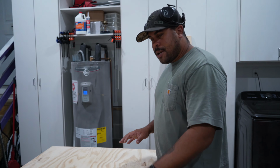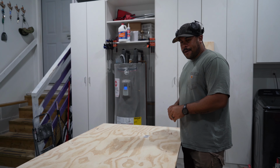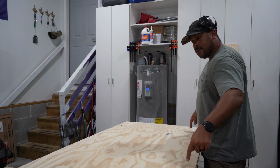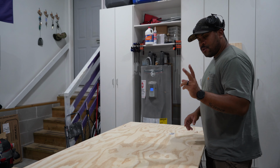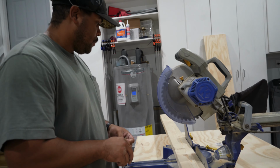All right, so the worktop is done, 3 foot by 6 foot. Next, we're gonna start building the framing. First, we're gonna build the horizontal framing. We're gonna do 2 layers of 2x4s, one that goes right into the countertop, one's gonna be down closer to the floor. This is upside down right now. And I think we're gonna do it with a 2-inch lip along the edges of the entire workbench. So next we'll measure and cut some 2x4s and start getting that put together.